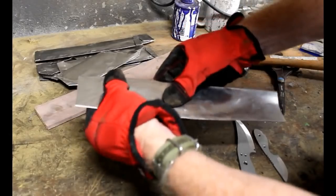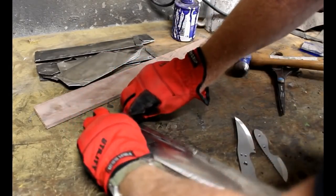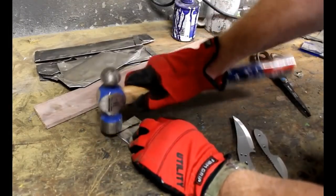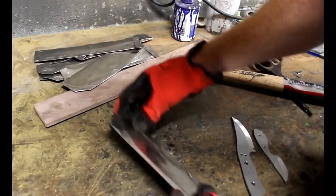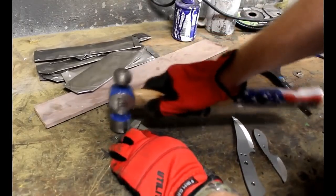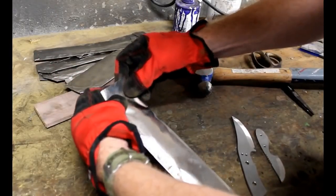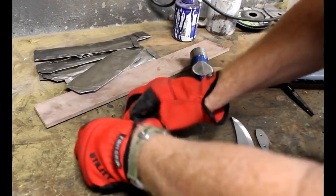Tool wrap is a stainless steel, very thick foil. It comes in two different thicknesses. Number 309 is good for heating up to 2,240 degrees, and number 321 is used on heat treating required up to 2,000 degrees.